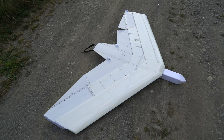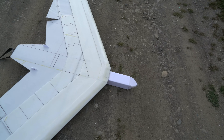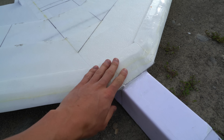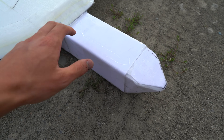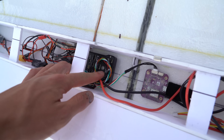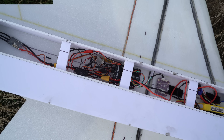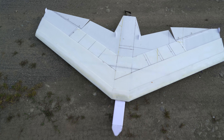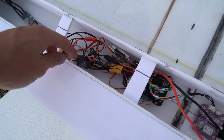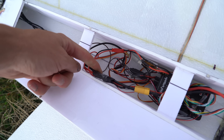It's a few weeks after that maiden flight. Since then I've extended the nose so I don't have to put as much weight in the front to get the CG right — the battery is now mounted up here. It's quite a bit uglier but hopefully it'll fly better. I've also set up the ArduPilot flight controller system on a Pixhawk inside. I haven't flown it with the autopilot yet, but I've also added a current sensor on board so that'll tell us exactly how much power it needs to sustain level flight.